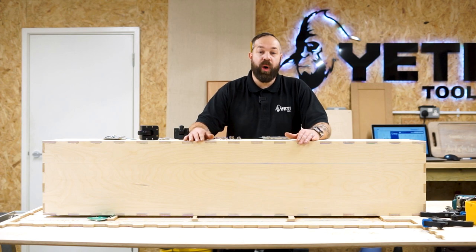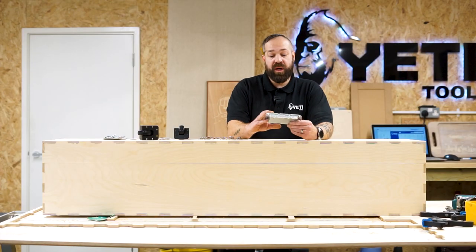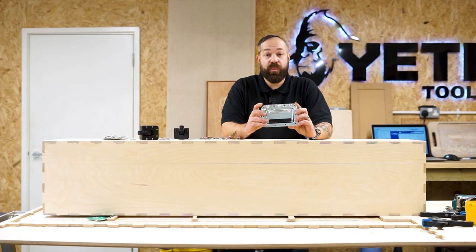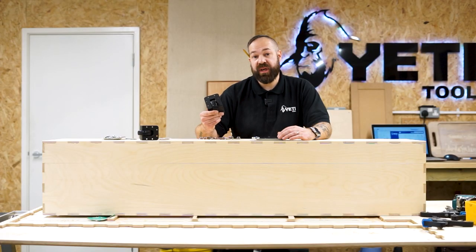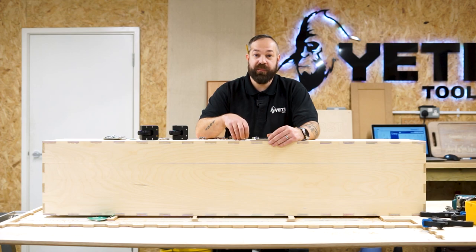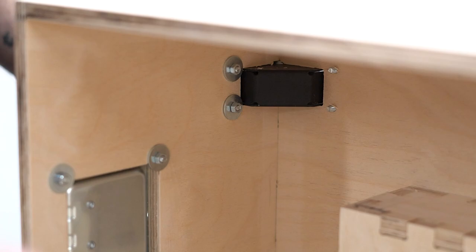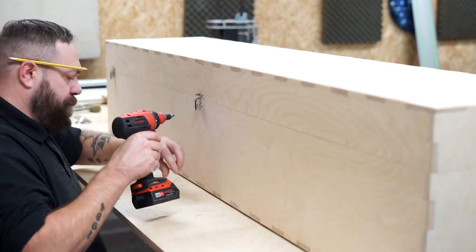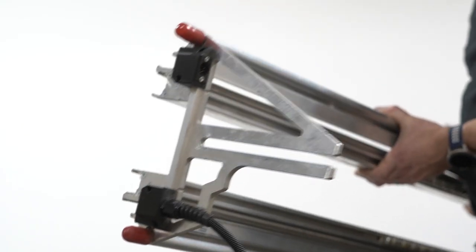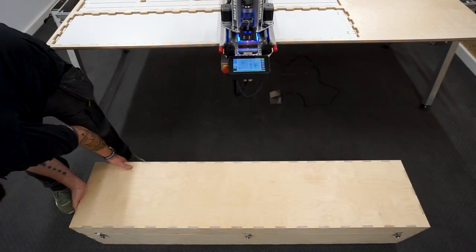We've got our lid fitted back on the box and secured the extra stretchers on the inside of the lid so it all sits flush and adds plenty of support. We're going to drill some holes and nut-and-bolt the flight case handles into place. We're also going to use nuts, bolts, and some self-tapping screws to fix the transportation wheels. The last thing is to fit the clips — that's effectively the main box assembled and finished. We'll then drop the lower and upper part of the X-beam into the flight case, fix it all together, and this project is all done and dusted.